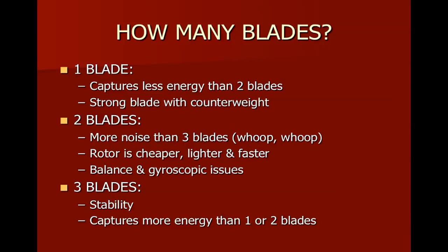It has another way to control itself, because if we're not going to have the blades pitch in order to slow them down or be aerodynamically designed so that they will flutter and stall, then we have to have another way to slow the machine down in the event the wind blows too hard. And one of those ways is using what's known as tip brakes. The Gaia uses these tip brakes, and they can give you what's known as a nuisance trip, because if they flap out, then you're going to lose the aerodynamics of the blade and you'll lose performance.